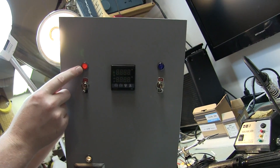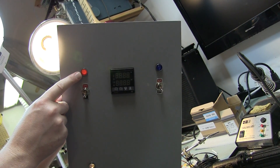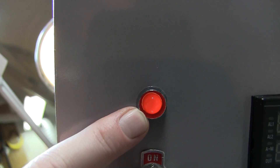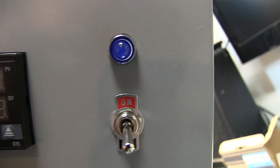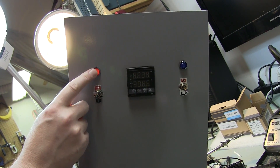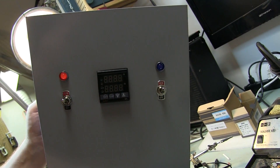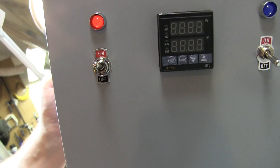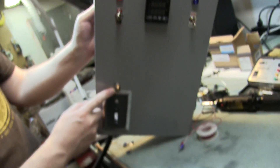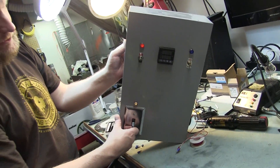For indicators we did this red LED right here — big giant 10mm. These are standard DC low-voltage LEDs. You can get big LEDs that will handle 220 AC natively; I had some of those and the parts to make a half-wave rectifier to run them. So even if the PID says it needs to turn the element on, you have to flip that switch to actually make it turn on, and this LED will pulse with the element so you'll see when it's off and on. This one is going to be for the pump — that's just 110. Whenever Joe needs the pump on he'll turn it on. We'll have another LED for the mains — blue for water, red for the element (red for dead, if you're familiar with firearms), and we're not sure what color the mains will be, maybe green or yellow.